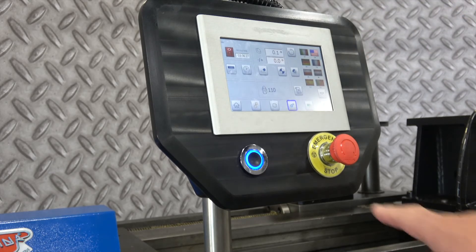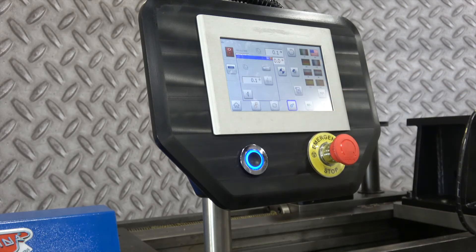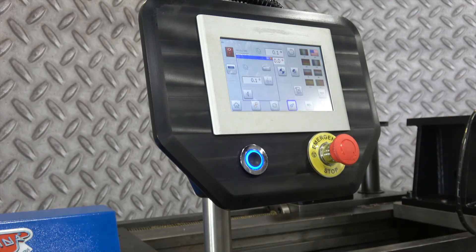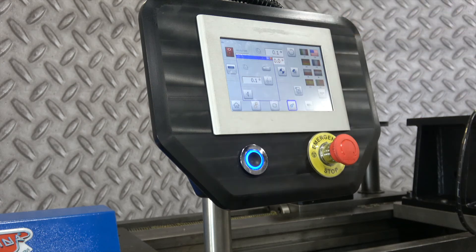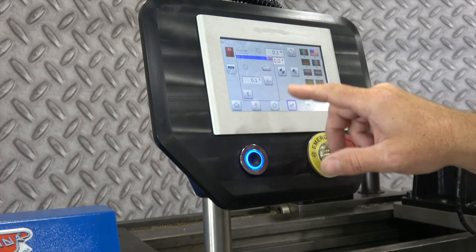This crosshair here will reset the counter bend die axis if you want to zero it someplace else — if you wanted to move it forward. So if you change the radius of the tool and you have to reset the position of the counter bend die axis, you would want to zero that. Mostly it should be taken care of automatically when you switch the can in and out though. It's simple to do.